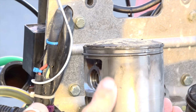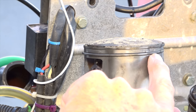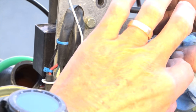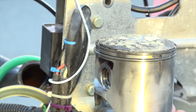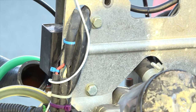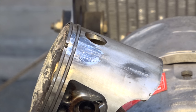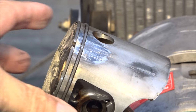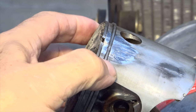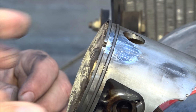There's a pressure mark there, pressure mark there, pressure mark there. That's actually a seizure right there. It's not rough though — well, this one looks rough here. So where's the melting? It looks like it's melted right here. It's stuck right there — that's where it's pivoting right now. The pin is there. We're going to have to get some closer shots once we get it off.